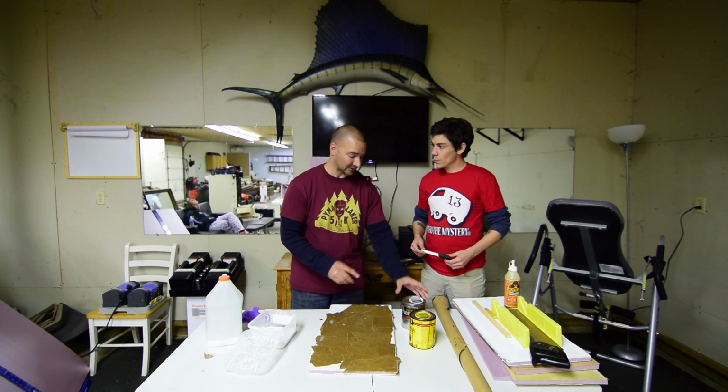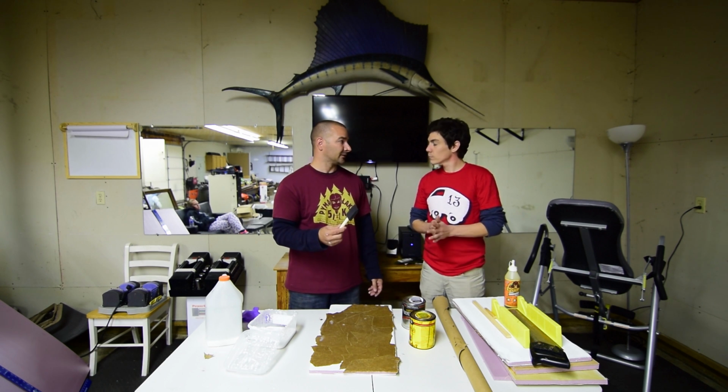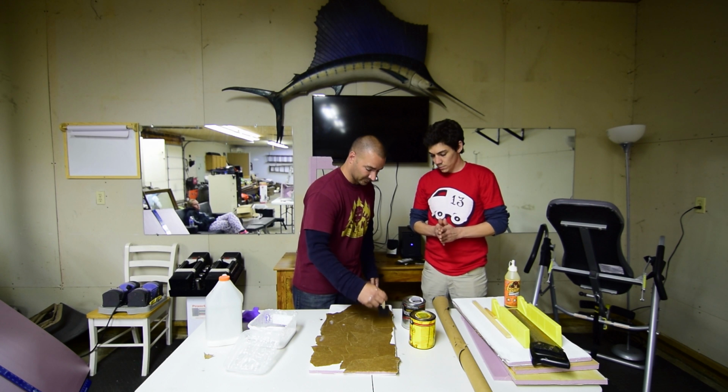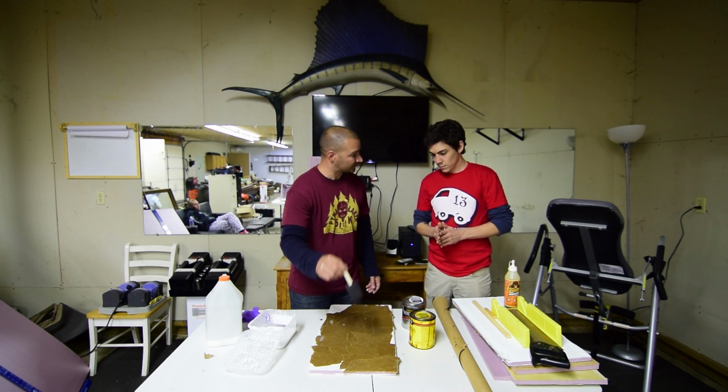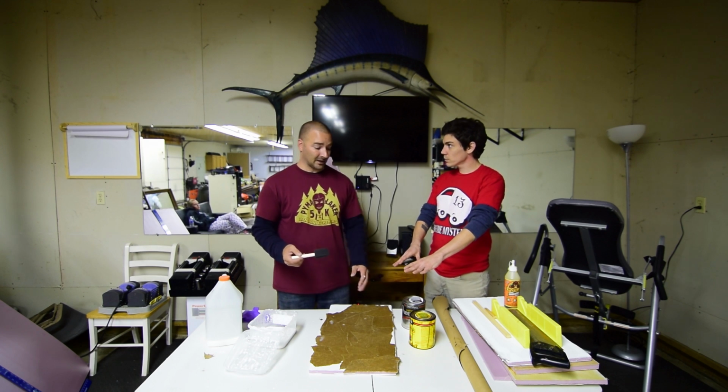But once that's done, and it's stained to your liking and it's dry, we're just going to take the polyurethane and these cheap foam brushes. I think they're a little over $1. They're super cheap, and you just brush it on in long strokes. And that's it? And that's it. And just one coat of each?